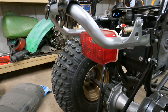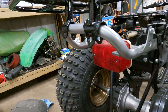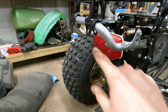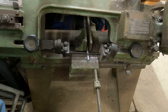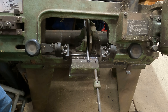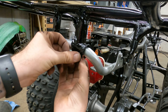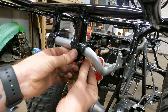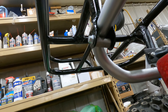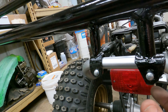We need to know how long to make those pieces, so I want to measure this pipe — I'm getting about nine hundred thousandths. So we're going to cut them about seven eighths of an inch long. Now we're going to be able to just take our bolt, stick that in there, put our nut and washer on the other side — just like that. That'll make it so we can clamp on that really well without really squishing these.